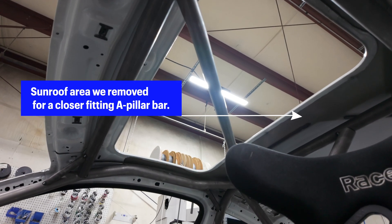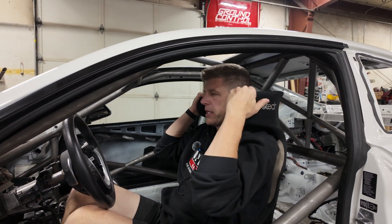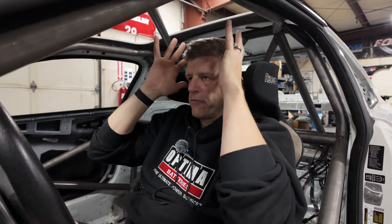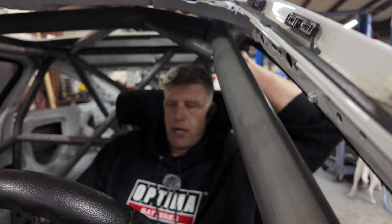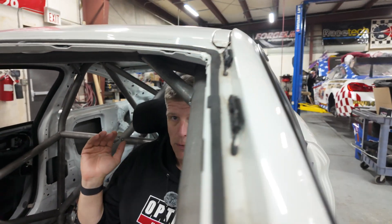As you can see, James now has all kinds of headroom in there. Generally when I sit in a car, I want head height and eye height to be able to see over the hood — that's kind of the same whether you're short or tall, so you have to base this on the head. I have a helmet on when I'm racing this car, and I want a fist of clearance from my bare head to any point on the cage. That gives me the room I'm comfortable with because the head is the most important thing in this environment. I'd like to keep this for Monday morning after I'm done racing, no matter what happens.